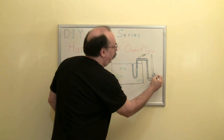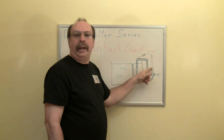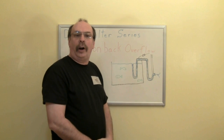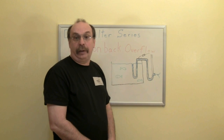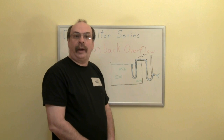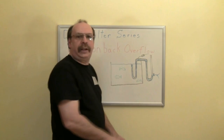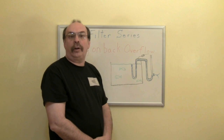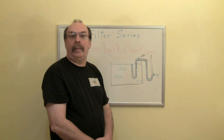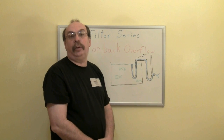Water then exits out to discharge. This vertical pipe here is an air pipe — it has to be higher than the level of the water. Without it, the overflow would not work; instead, it would just be a siphon. With an overflow device, if the water level drops below that of the standpipe, it will automatically stop. As soon as the water level rises above the standpipe, it starts again automatically — no need to reprime, as you would need to do if you had used a siphon.